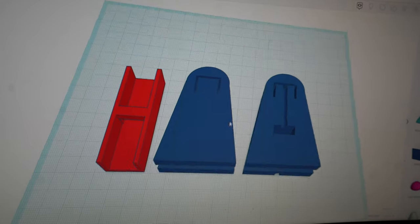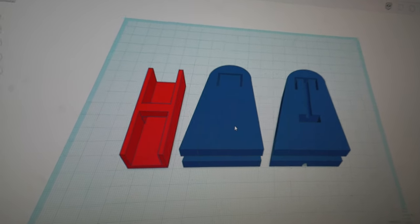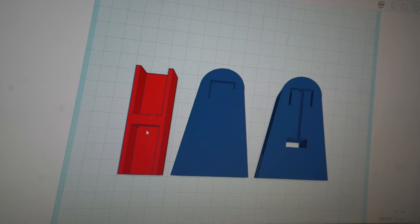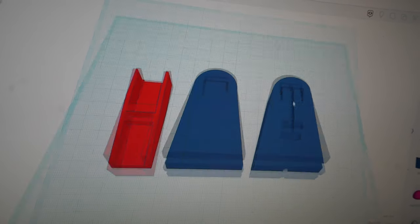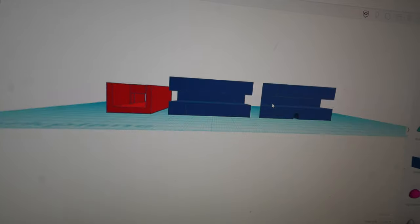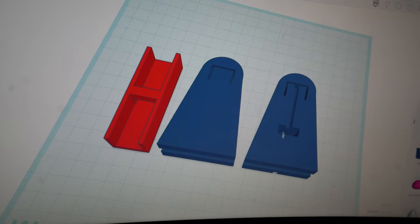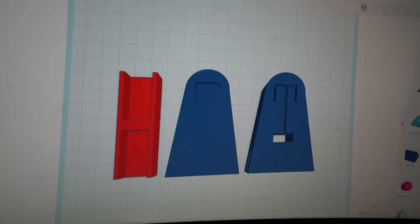This is part of the light that I'm designing for the fish tank. I bought some aluminium c-section from Bunnings and knocked up these designs on Tinkercad. The fish tank is wide enough that it needs two sections, so this is a little joiner that I've designed and printed. The c-section fits into this part on each side, the cables run through there and come out underneath, and that's where it mounts to the tank — just sits on the glass. This program Tinkercad is a free online CAD design software; once you've got your design you export it as an STL file which is what the 3D printer reads.